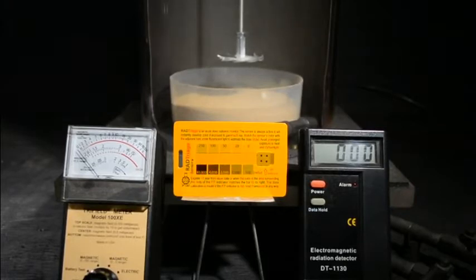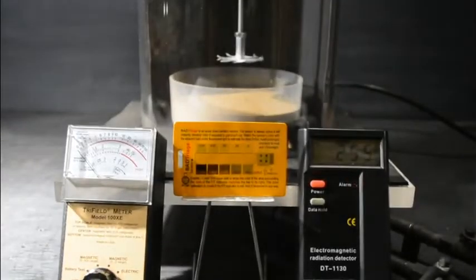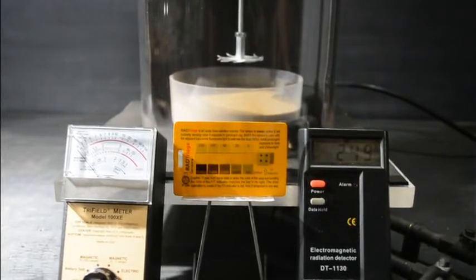It should take about a second to get that pulled down, enough to get an arc going. I'll go ahead and turn the thing on, and you'll see this movement inside the clay. We just have clay in there. I got about 60,000 volts on in there. When the vacuum gets sufficient, we'll be able to see the glow mode plasma. There it goes.